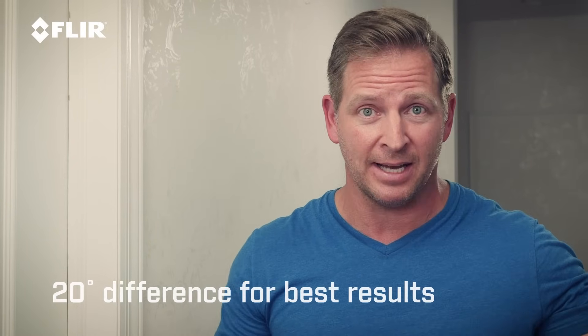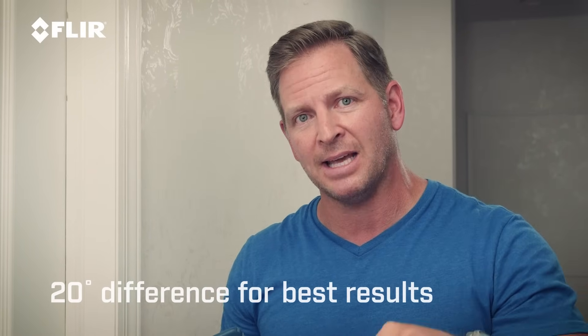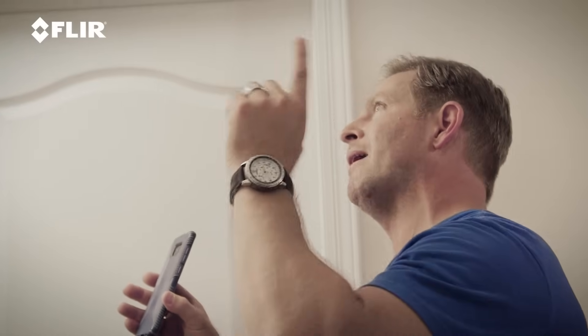Today it's 90 degrees outside and 70 inside because the AC is on. So by using my FLIR 1, I can walk around and spot all these issues, mark them, and have my guys go up later on and address them. Normally what happens is maybe somebody was working upstairs, there was an animal — there's some reason that insulation got pushed aside, or there was never any there to begin with. This is how you can spot that.